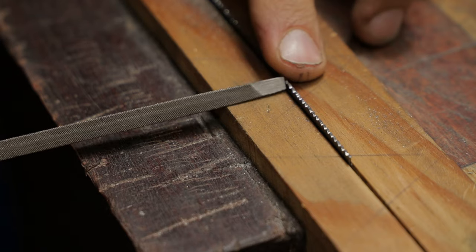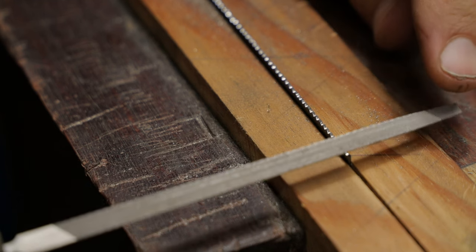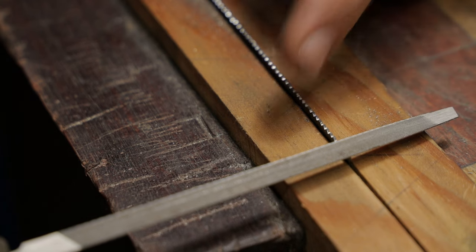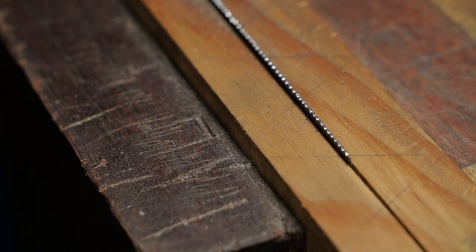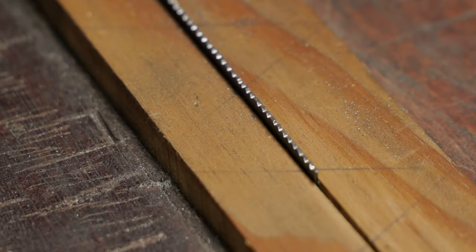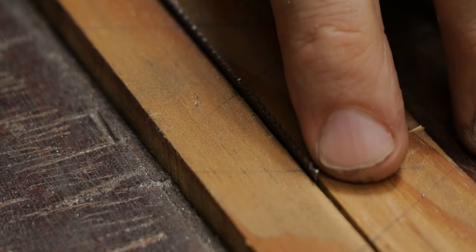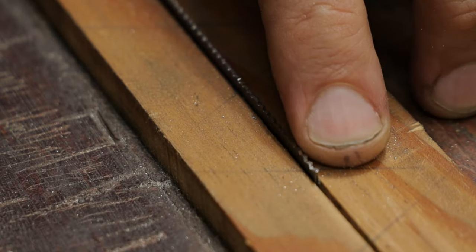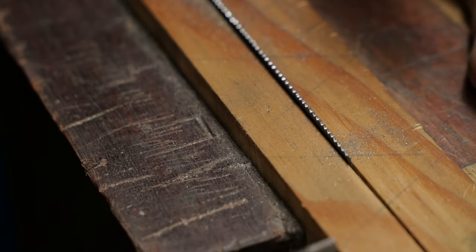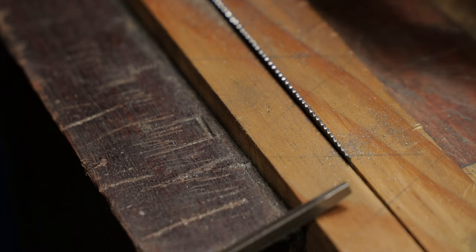So now they've gone through and you can see these marks along here — it's almost the same as just sharpening the saw now. But we still have to define the teeth a little bit better from these points. As this is a rip cut, I'm going to be bringing this in at 90 degrees doing two runs, and I'm going to keep going until I see the tooth looking like a saw tooth. Then we'll come back through and do the final refining which involves sharpening on both sides. If you want to know the difference between rip cut and cross cut, I have some videos like that so I'll leave them in the description below.